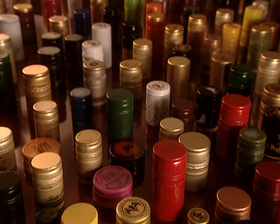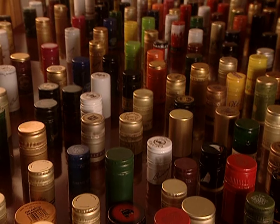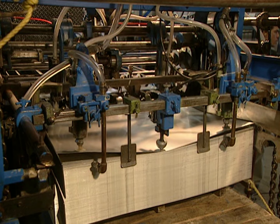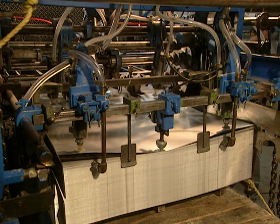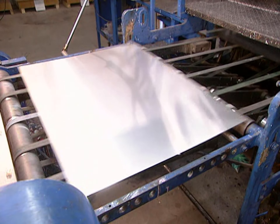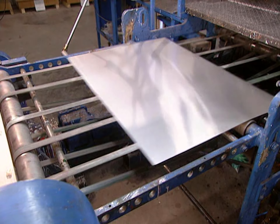There are hundreds of everyday objects that are capped. This plant makes 250 million metal screw caps yearly in 12 different sizes. The caps are made from 11-square-foot sheets of aluminum weighing one pound. Some 3,500 thin aluminum sheets pass through this feeder.